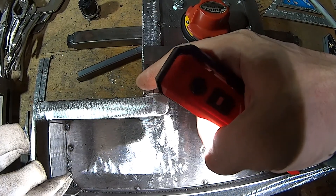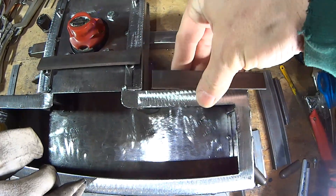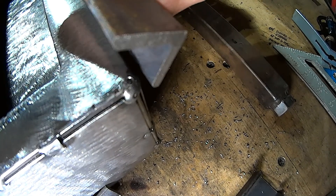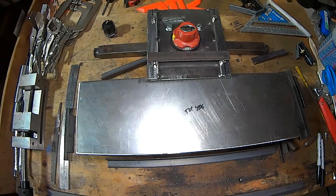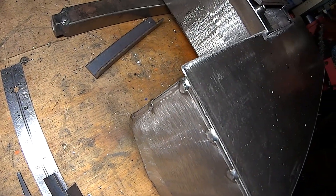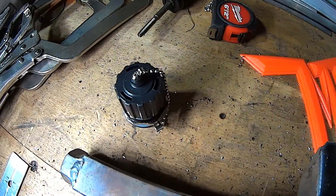I left some gap here, particularly on the hinge side. I don't know exactly how much I need but I left about a quarter of an inch. I'm hoping I can open and close the door without the angle iron catching. I've got the angle iron set off about a quarter inch so when it opens up it hopefully goes by — I may have to trim the edge to make it work. The other sheet metal I left with about a half-inch perimeter, and it actually hangs over in the back a little bit to help with the hinge issue. We'll adapt and overcome.